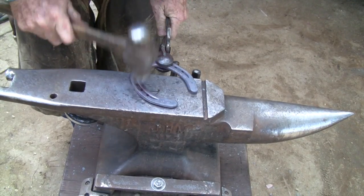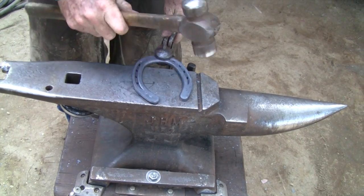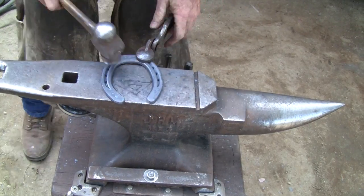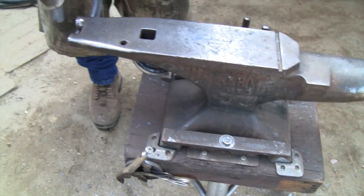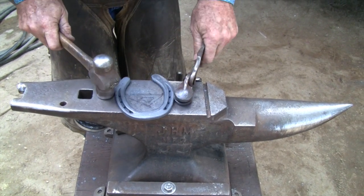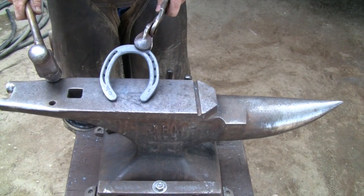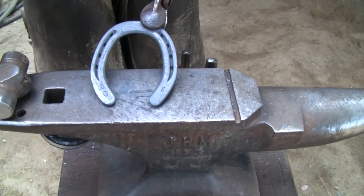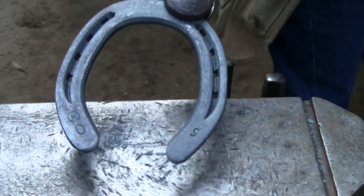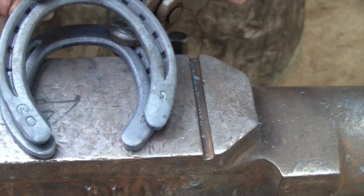Finish shaping the shoe. This will give about 1 to 2 millimeters in width, and about another 1 millimeter in length. You don't need a creaser, and the ground surface integrity of the shoe is maintained. Quite a bit of steel can be moved with a simple modification. When you place the original shoe over the modified shoe, you can see how much metal is gained in this process.